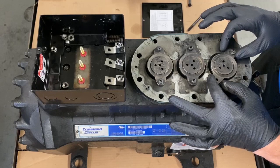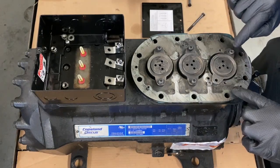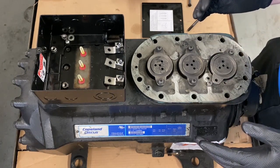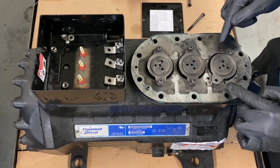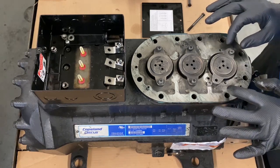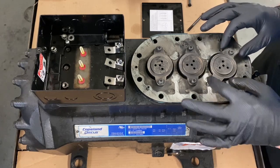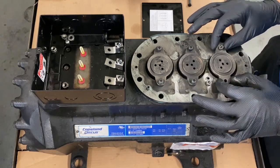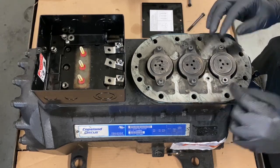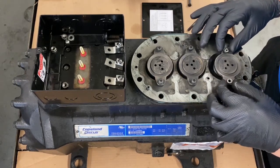Look at this — this is your discharge backing. Look how the bolts backed out and now it's all damaged. What could cause this? I know just from looking at this what things would cause this — this is from compressing a liquid. This compressor took a slug. What happens with a slug is it stretches these bolts. The compressor still runs, there's still some vibration, it backs these bolts out, and this bounces around in here.